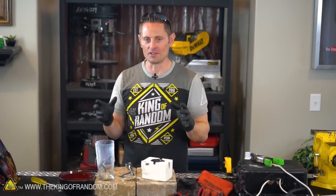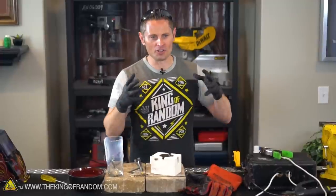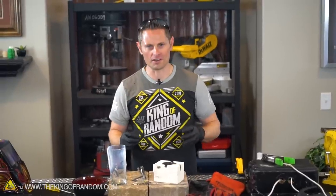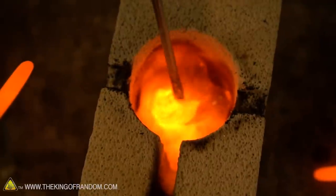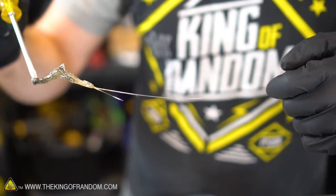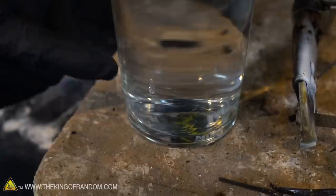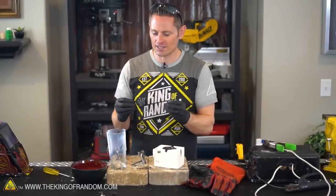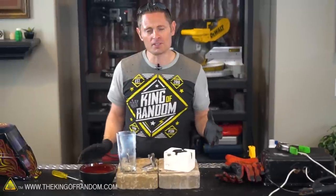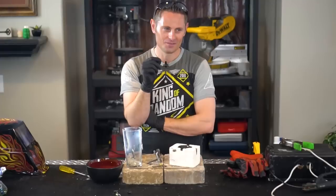Quick summary of what we did today: we started with the purpose of seeing if we could use high amperage electricity to melt glass. We took one marble and exposed it to the electric arc, and found it melted within seconds. We threw in five more marbles and melted them in less than a minute. We threw a whole handful of colored marbles in and melted them down to a bubbly liquid lava-type soup. We found that pulling a screwdriver out slowly creates strands of fiberglass. We tried dripping molten glass into water, but it missed and fused to the side of the glass instead. For our last experiment, the electrodes formed an improvised glass-cutting plasma torch where the glass flows away like butter. These were very cool experiments - we now have the power to melt glass.